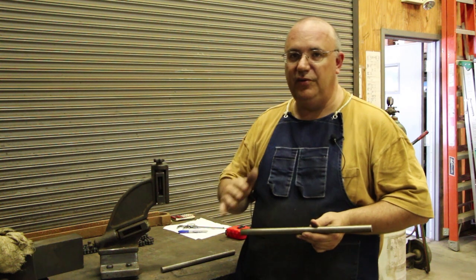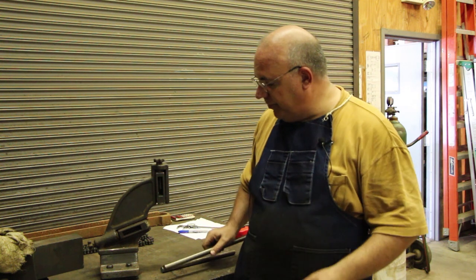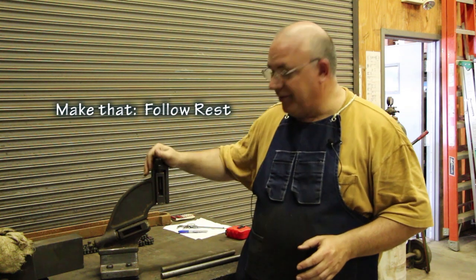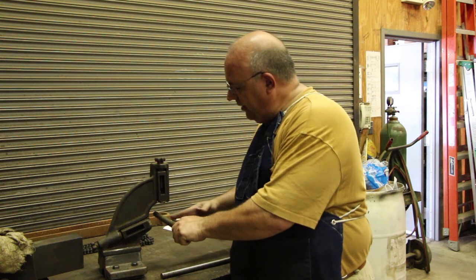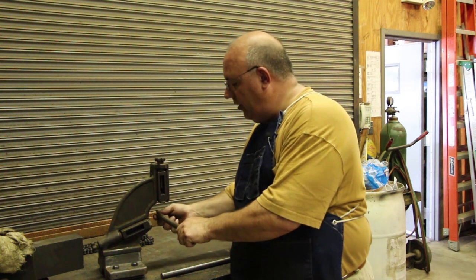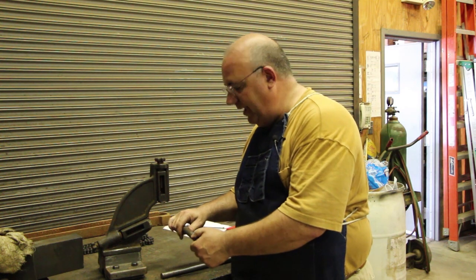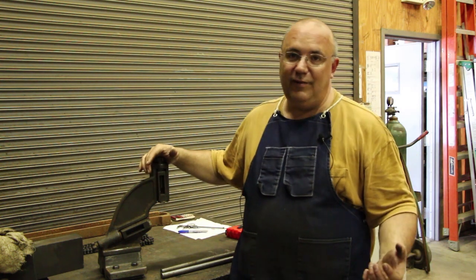The reason I'm shooting a separate video for this — even though I've already shown it in an earlier video — is that in my last videos I got a lot of questions about why I didn't use a steady rest on my lathe. A steady rest puts pressure on the rod as the cutter comes in, holding it in place to keep it from flexing. On smaller diameter, longer pieces, the rod can actually bend on the lathe, making it difficult to machine.